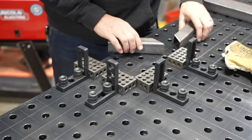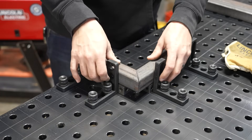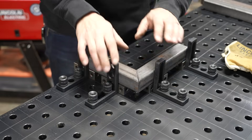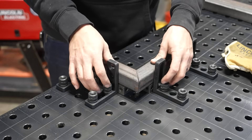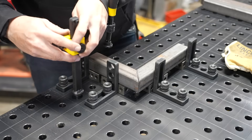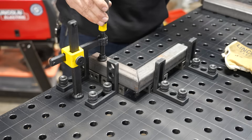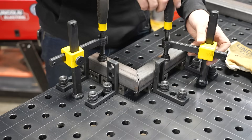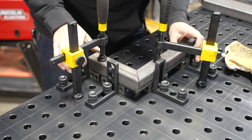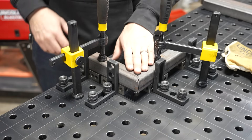I've set up these little blocks here and we're going to be using some inch-and-a-half by inch-and-a-half by one-eighth inch wall tube for our test. This is easy to replicate in furniture, shelving — it's pretty structural and good for holding weight if you want to make a desk or a chair. This is pretty normal material I'll use on furniture and decorative projects in my shop. Our fixturing and clamping is really important, and I beveled my tube before we did this weld.